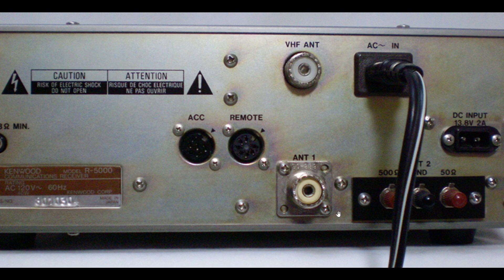But if you have a transceiver, that's a different story. On transmit, matching the antenna is extremely important, or else you could end up with troubles with the transmitter — and that's not a good thing. So the spring/screw connectors are mostly meant for wire antennas, and the coax connector is mostly meant for well-matched antennas. That's why most radios have two types of connectors available.